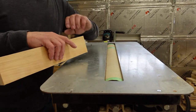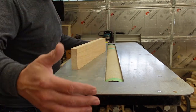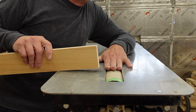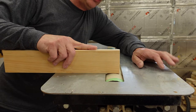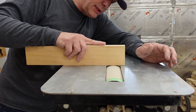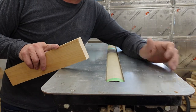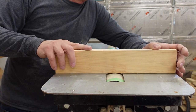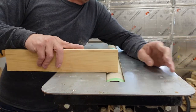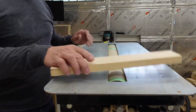One of the questions was how do you adjust the height of the cylinder. On the sides you can adjust the height of the cylinder, and where you want to have it set is that when you have 220-grit sandpaper on your drum and you pass your piece of wood across it, it should just barely be touching the cylinder. Right now this is 80-grit so it should be touching the cylinder when I go across, but it tells me I definitely need to bring it up. I'm going to do that right now.